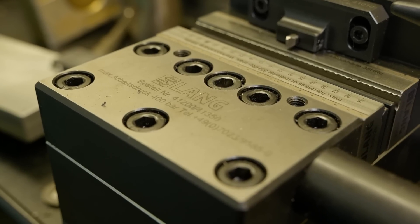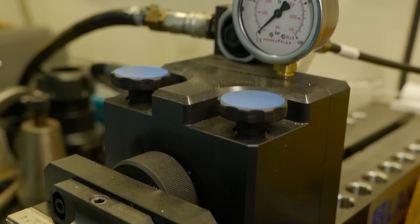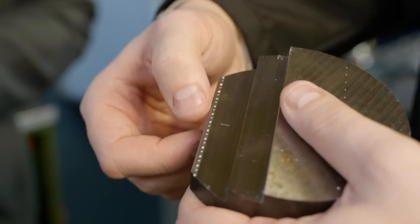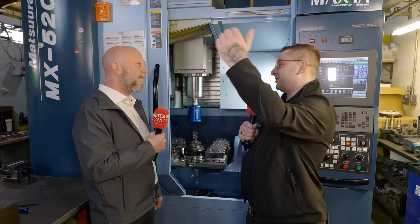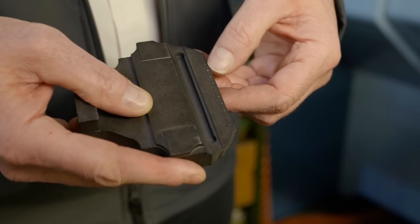This part actually goes through quite a few operations. I want to have a quick talk about the stamping machine from Lang, because you're not just using it to stamp and grip — you're using it as a datum as well. It's our work datum, so every operation after the first is located and relocated with heat treatment operations and other machining operations in between. We continue to use that, hence the extra tag that's on there, which remains all the way through until we wire it off at the end. You stamp the billet to start with, it gets machined, goes out for heat treatment, comes back, gets machined again, and that part is going to be in the exact same place every single time — just from the stamping technology of the vice.